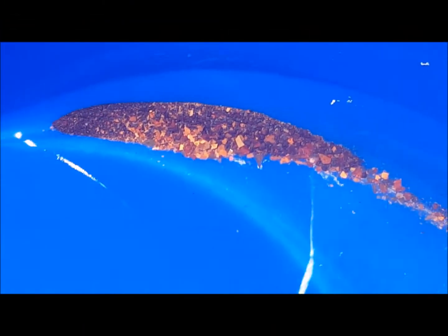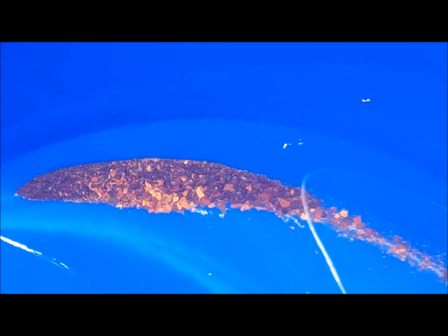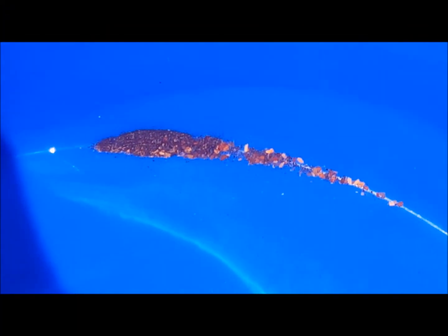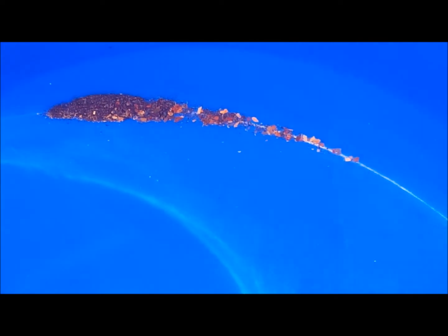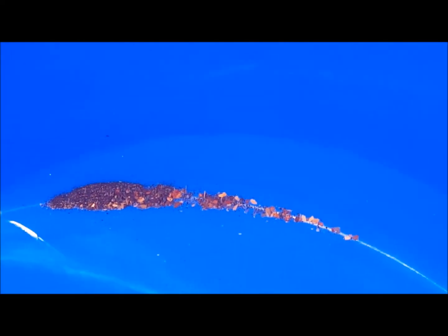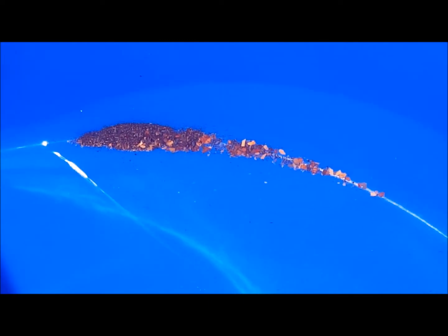I'm going to put air in there along with the water and see what else comes out. After blasting it with air, look at all this stuff that came out — I'm hoping this cooler is going to run a lot better. After one more blast, a little bit more came out. It's probably hard to tell the scale, but this last pile is about a third of the size of the previous one. So I'm going to call this good, put it back together, and see how the temperatures look.